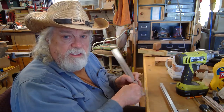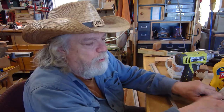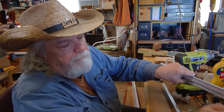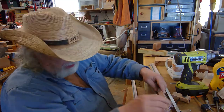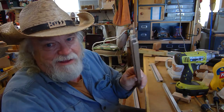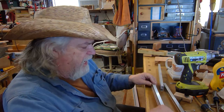I also use these as a straight edge because they're nice and truly flat. If I put a bolt on here and use my two bench dogs, I can drop the t-track in and lock everything down with a nut on the bottom — the t-track then becomes part of the bench and I can use it as a t-track, then take it off when done. So I don't have a permanently mounted t-track on my bench, just bench dogs. The double t-tracks also have a ruler on them, and I use them for checking work for flat and as winding sticks — just very handy.